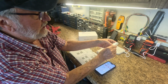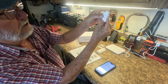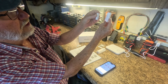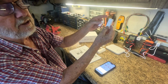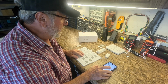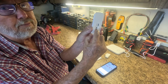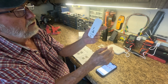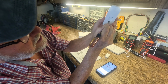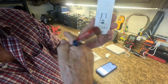Okay? And I did pull the paper out, and you can see right there, every time I move these apart, okay, they're together. Now when the door opens, there it comes on and then closes. That will send a signal to the alarm unit and indicate an alarm. Okay, now this is the infrared, and there's an on and off button. These don't have on and offs, they're on all the time. And right here is the little switch, it's in the off position. You need something in there to push it over, and it even says on. So it's on to the left.